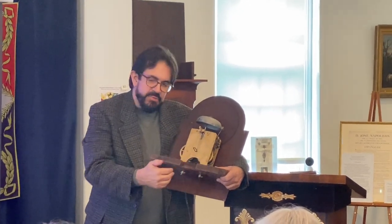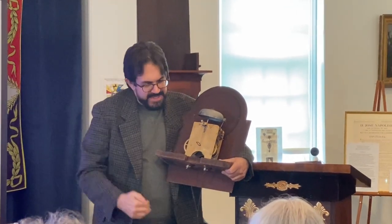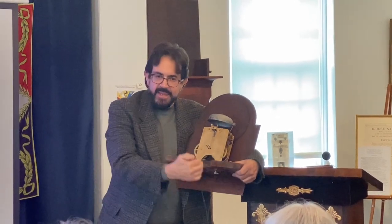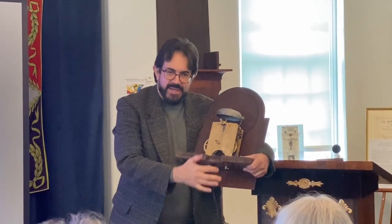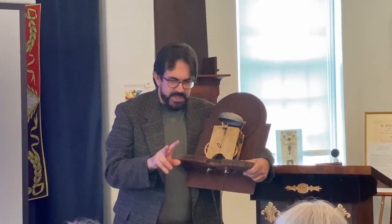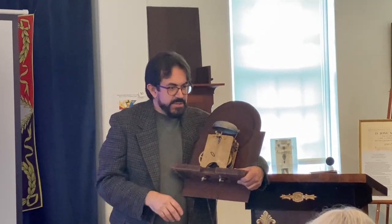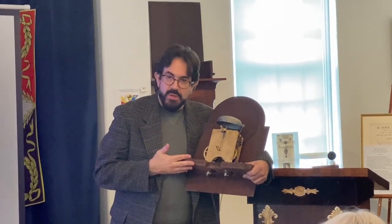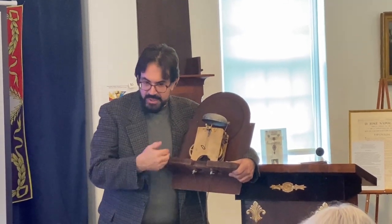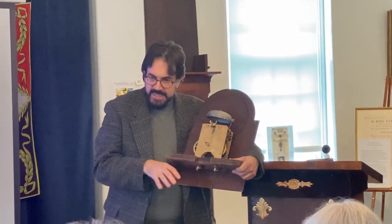the mathematics is, when it gets swinging, you have gravity pushing down at 9.8 meters per second squared. As it swings that way, gravity pushes down on the top of the pendulum ball, and it makes it go back, gets momentum and comes back, and it goes back and forth. So the weight is your power, and we have two types of power. I'm jumping all around here, but I'm just trying to give you a general background, if anybody has any questions. Two types of power with any clock: some tall clocks have springs, so you have springs, you have weights. This guy has weights, okay?